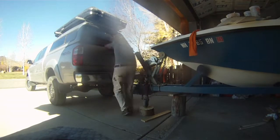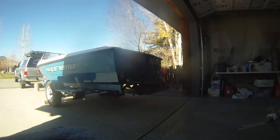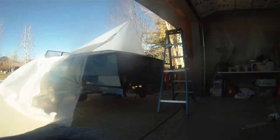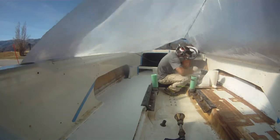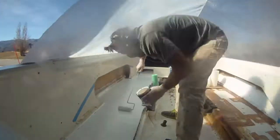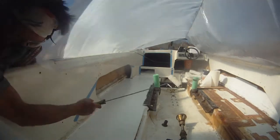I had thought after I gel coated that side that I was done and wouldn't be bringing the boat back in the driveway. However, after a closer inspection, the gel coat wasn't quite thick enough in areas — the texture from the mat was showing through pretty heavily. So I'm pulling the boat out one more day, mixing up gel coat, and finishing off the can. My roller is a little bit seized up from not doing a good enough job cleaning it the day before, but it's good enough. I do a second coat all the way through, a little bit more up the nose, and lean in to get a little more coverage.